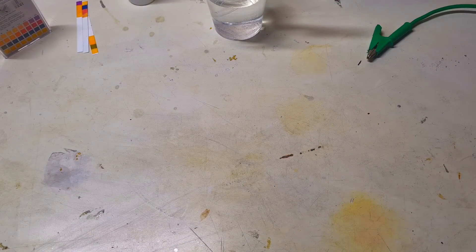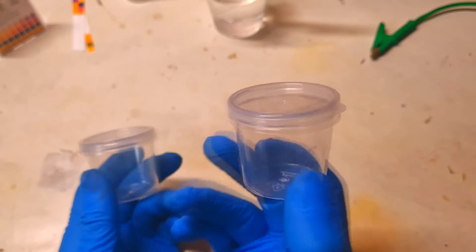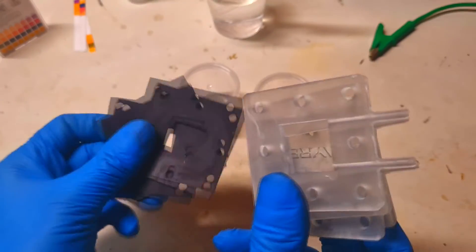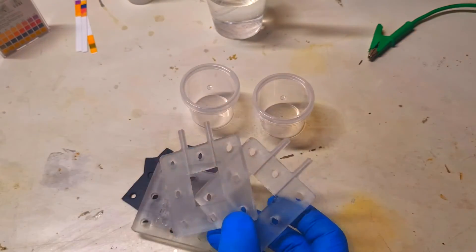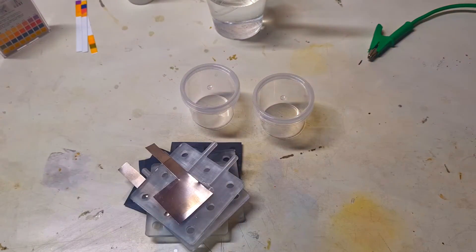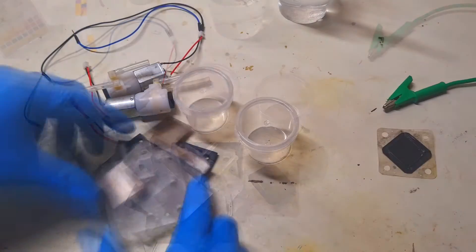And now I will also make some salt water flow battery. To make this flow cell I will use these two plastic containers which will serve as electrolyte tanks — one will be for the anolyte, the other will be for the catholyte. The cell I will make from these 3D printed parts. These two are the reactor plates, which I will fill with carbon felt. I will also use this titanium foil for the current collectors, the Nafion membrane, and two pumps — these are the basic materials I need for making a flow cell.